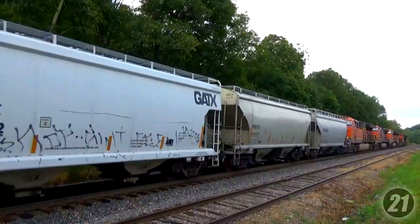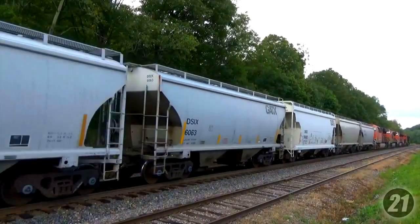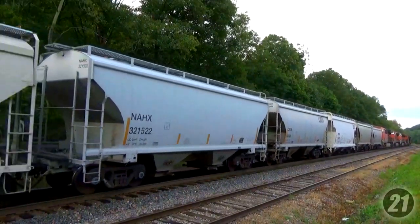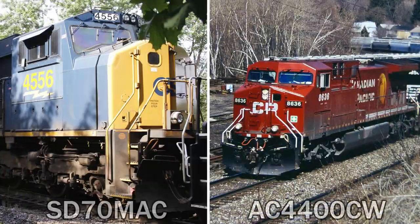DC traction motors also have a nasty reputation for burning themselves up at low speeds, making DC locomotives less than ideal at low speeds. Example, heavy coal trains on a grade. Now, I was talking about DC motors as opposed to AC motors, so I'm wondering if there's any correlation and/or causation.